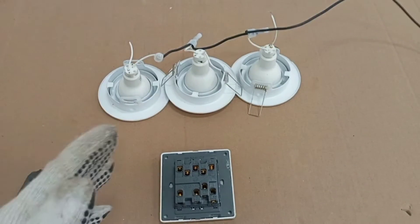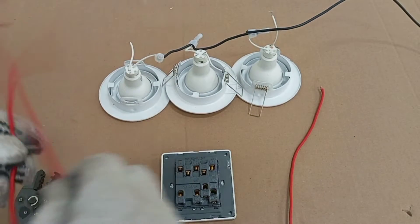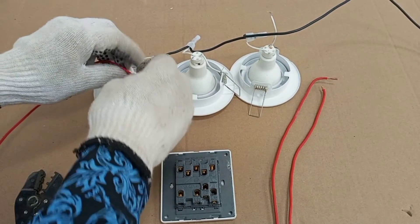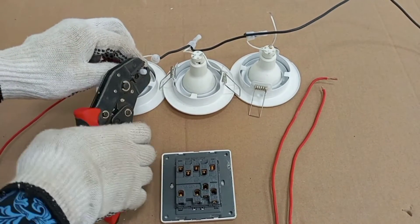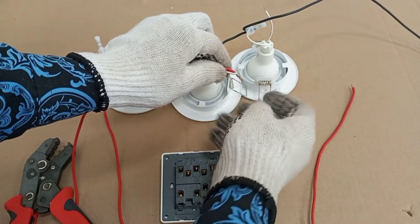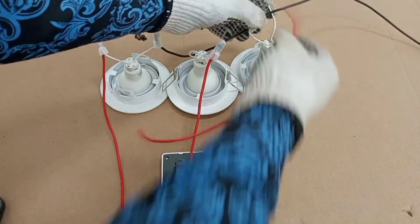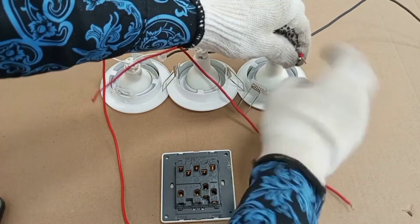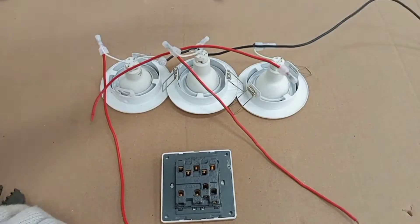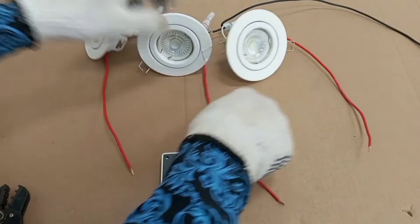Then I look for three switch wires, one from each lamp to a corresponding terminal of each gang. I have one, two, and three switch wires. The first one connects from the first lamp — I gently crimp it. The second one connects to the middle lamp. Then the last one connects to the final lamp. That is properly done and we can properly position the lamps now.